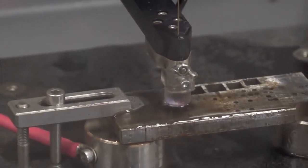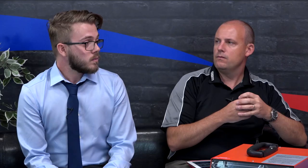It's just gently servo-driven down, and all the work is done by the jumping of a spark between the electrode and the component. How about deformation in the material? Not anything you need to worry about. In some aerospace parts, you have to monitor what's called the recast layer, but we haven't had any issues. You select the material in the control and it works out the parameters. You tell it the electrode material and the workpiece material, and it pulls out the default settings that are the best ones to use.